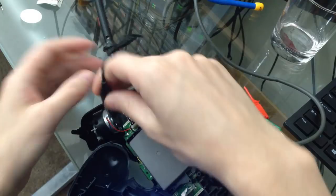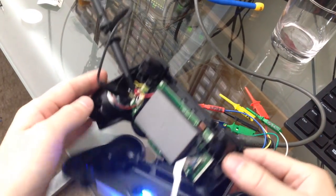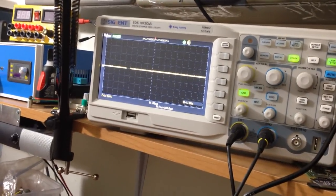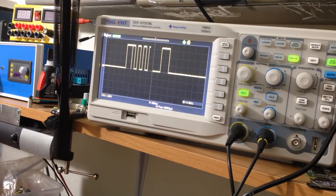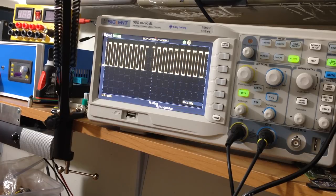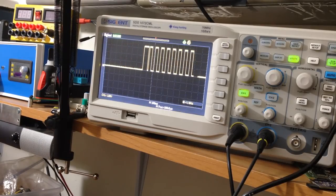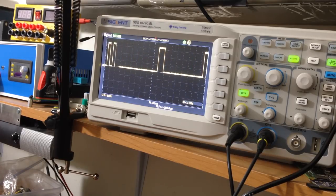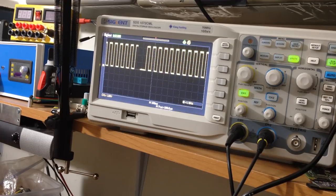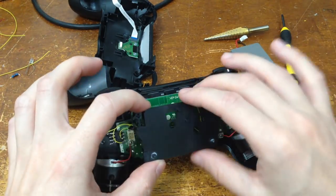The oscilloscope is probing the output pin. Now it's off, but when I click the button it starts firing. With a little trial and error I figured out what I needed: I just wasn't clicking the button fast enough. A fast click turns it off, and another fast click turns it on. If you wait too long it won't activate the toggle mode, so it's got to be a pretty fast hit. But I can reliably turn it on and off just by clicking that L3 button.